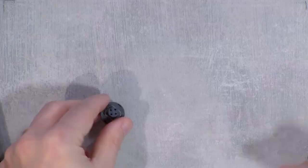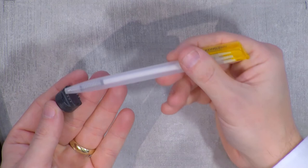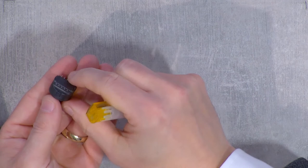So as you can see here, this is just an example. This is something we call M12 with integrated transformer. At the bottom part of the connector, we have the contacts. In this case, this product is suitable for surface-mounted technology. So this means this product is suitable for the reflow process.